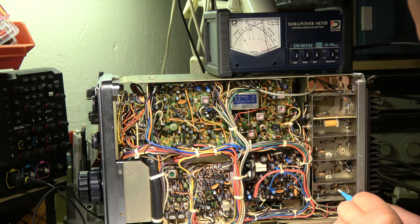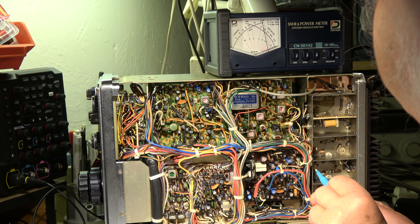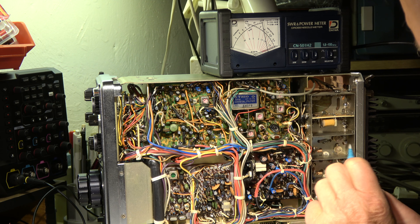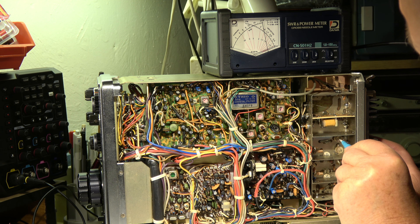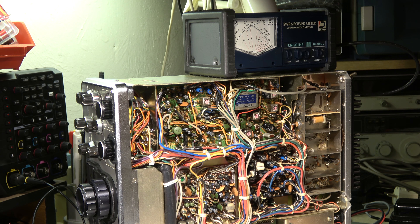I can improve — I'm operating at 144.500. I want to have the maximum output power in the SSB range, not in the FM band. I cannot really improve it — it is at best output power. It is 20 watts and now we have 4 amp power consumption at 13.8 volt — a lot of input power. Well, this is done — the final unit.